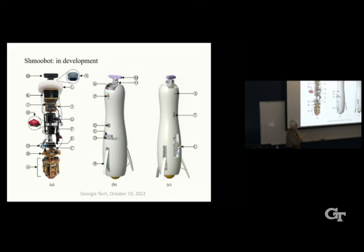So what we're working toward right now, pretty frantically, is making a body like this out of translucent polycarbonate. We'll have LED strips inside so we can actually change the color of the robot at will with the computer. So if we have multiple robots, we can tell them apart by color, RGB and so forth, or use it for signaling purposes for HRI applications. So here's the three tripod legs here. Up at the top, we'll have a pan tilt arrangement. And in the back, what we're working on is a mechanism that comes out of the body. There'll be some doors that open. It comes out of the body and plugs into an ordinary wall outlet, which we'll sense visually.